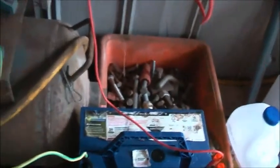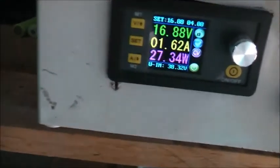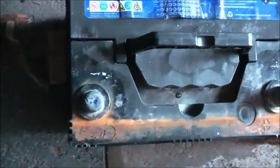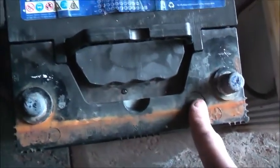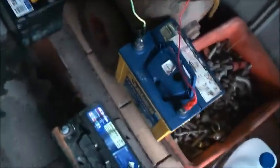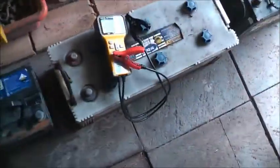Alum battery — see if I can clean things up a little bit, get it a bit higher in condition. I just converted this one to alum yesterday. Got a bit more performance out of it, but not much. I'll just give it a good kick before I did the alum convert. No big chunks came out of it, but I got a lot of sulphate lead oxide out of it, because it had sat for so long on zero volts. It's not as shagged as this other battery.